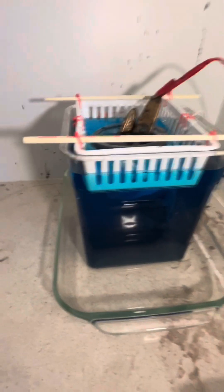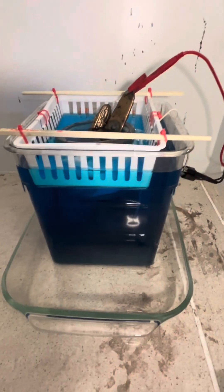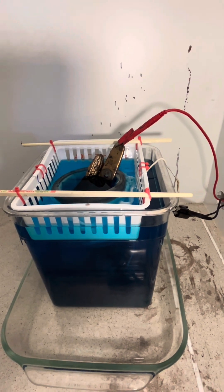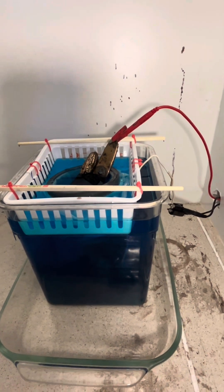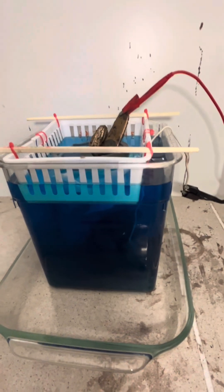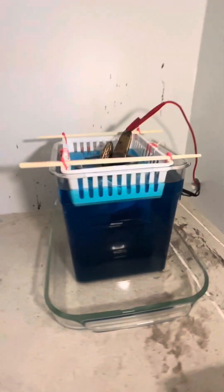We're back and this is the second part of the video starting up this copper cell. We are almost at 5 volts — we're at 4.89. I'm running this a little higher at 6 amps, trying constant current to go through this copper. We might have to reevaluate the vessel because it's a little close, but I don't see it growing two inches overnight. We're running almost 30 watts — 29.3 watts — and we'll keep an eye on those dendrites and how they grow on the copper brain coral.